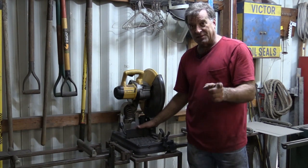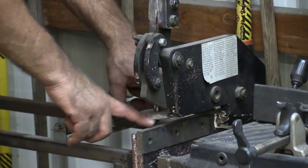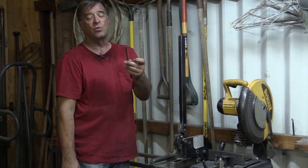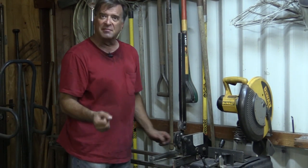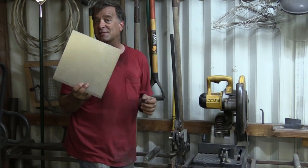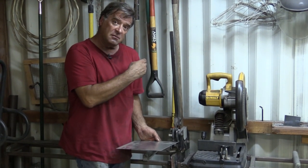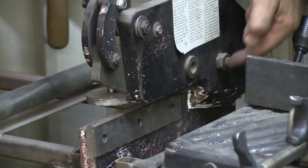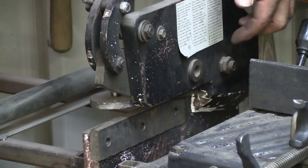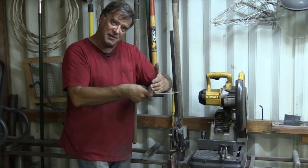If you don't clamp your metal in there, it's going to come after you. So the right tool for the job — this is called a plate shear. It works great on small stuff, small diameter stuff, and works great with plate up to a certain width. It's also great for quarter inch and less diameter where you can just run it in and snip it off where you want. But if you've got a piece of plate that's too wide, it'll work in this machine only for cutting a straight line, because it has a throat — a plate on the back that holds the upper mechanism together. You can't turn this as you're cutting through, so it will only cut a straight line.